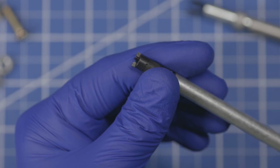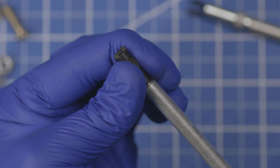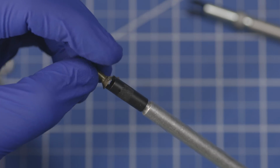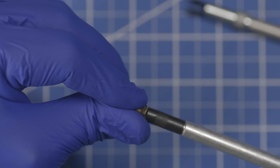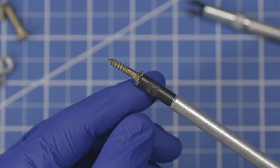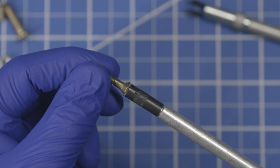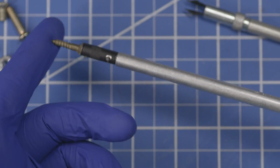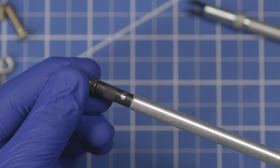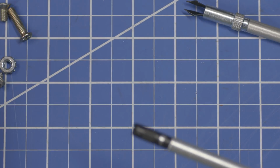The way this works, you can see that center blade rotates when you rotate the handle and kind of ducks out of the way to stay locked in that position. Then you insert that into the screw, and then when you push down with the screw, that center blade pushes up into the slot of the screw and locks it in place, which you can barely see in there. And then there's a rotational spring in here putting pressure on that center blade so that it's, again, held quite tightly. I'm not supporting this, and it holds really nicely. And then it's enough to get it started, and then you can easily, well, maybe not easily, but pull it away from what you're tightening it into, and it'll let go.